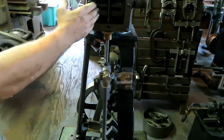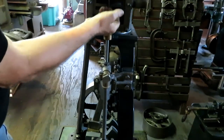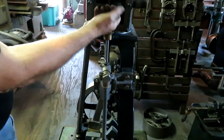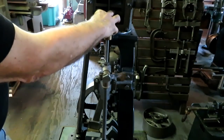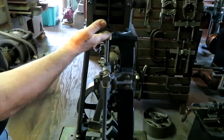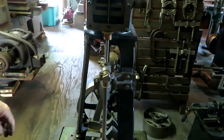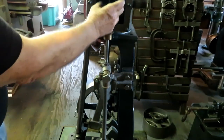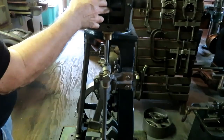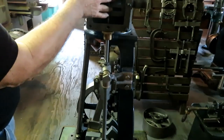Well, the problem is, how do you see the back side to know where the overlap and the cavity there that works as a valve is? How do you see that in relation to the ports very well? This Bilgram diagram will allow you to determine that by geometry. But plan B for me here is to build some kind of a slide valve that I can adjust and play around with until I get the exhaust ports to line up and operate as they should.